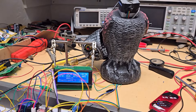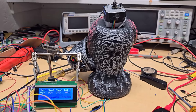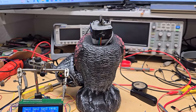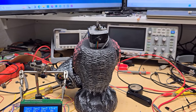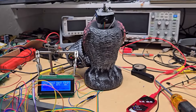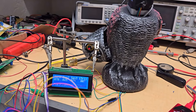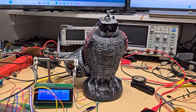So I have it homing and then going to the middle position to start, and then it's looking at these sensors - it's averaging the light. If I put a shadow it knows, so if a pigeon comes walking by, it's going to move the head to that position. After it moves the head, it's going to slowly pulse left and right, left and right. That's why the position is going 823, 822, 821 - just pulsing down, and when it gets to the end it turns around and starts going the other way.